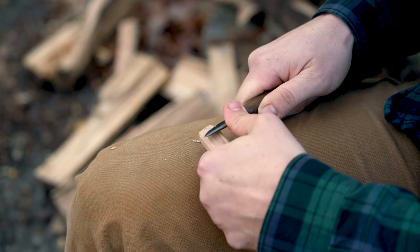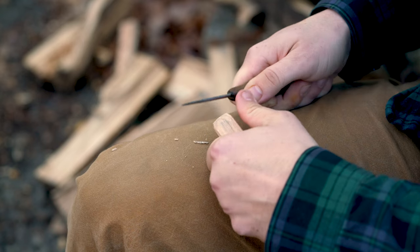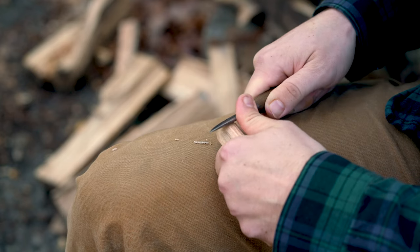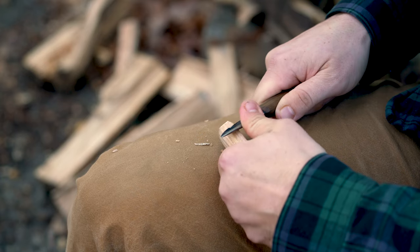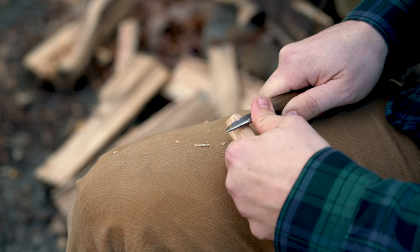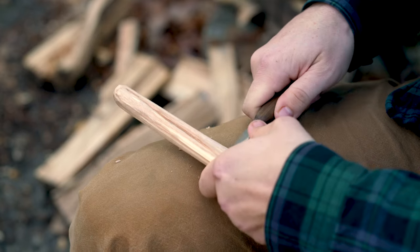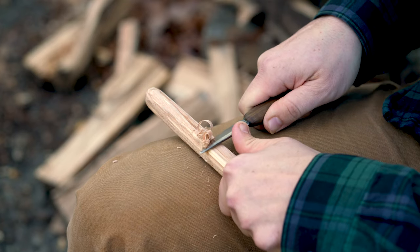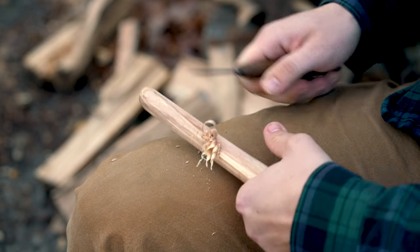You want to take small bites and be gentle with your thumb here. This one can lead to some calluses and blisters if you're a little overzealous. But this is a really nice cut for small detail and for zeroing in on some more difficult curves. As you can see, it's great for rounding off end grain and smaller, detail-oriented cuts. You can use it on the big part of the stick too — just get a little windshield wiper action going. That's the little push cut.